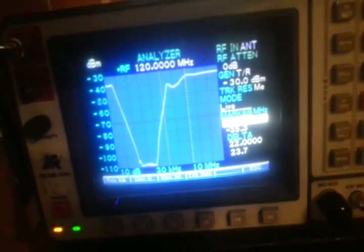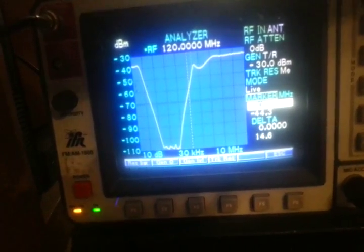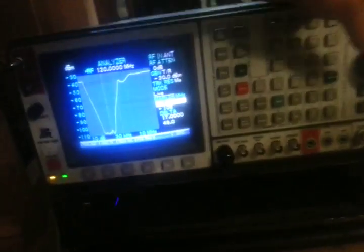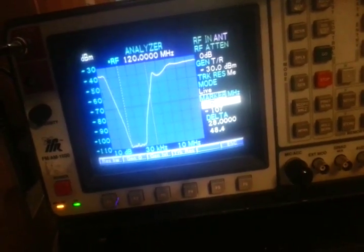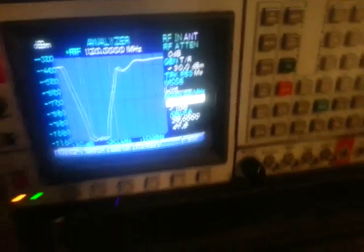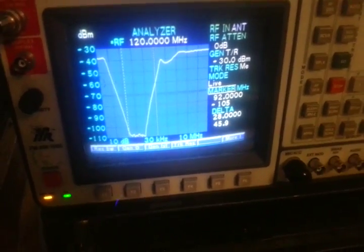I'm transmitting negative 30 dBm of power into it. As you can see, if I'm transmitting negative 30 dBm, minus the cables — they're going to be about 2 dB or so each, maybe 2.5 dB loss including the connectors. Realistically, the first frequency we need to notch out is 92 MHz, and as you see right there, including connectors, it has 70 dB of loss.